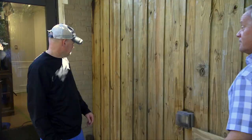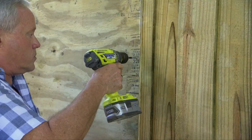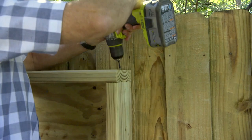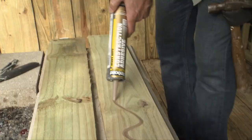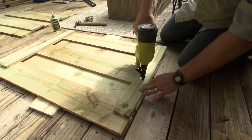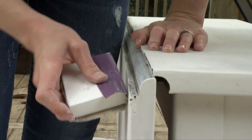Andy and Danny got out of painting — a good thing for everyone. For the TV cabinet, Danny has a plan in his head rather than on paper, which is a scary place to be according to Andy. Two-by-sixes are used around the plywood to form the box of the cabinet, and the TV mount is hung inside the space. Early the next morning, doors are made by layering rough-sawn fence boards in the same pattern as the deck fence.